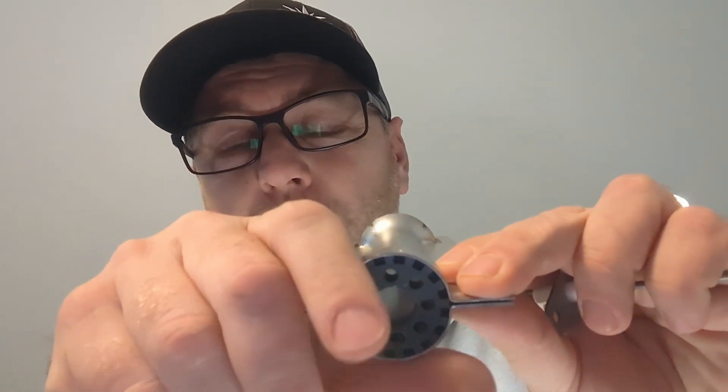It's bigger at the face of the burner and then it angles down and shoots into the heat exchanger itself. Majority of furnaces these days have tubular heat exchangers and your inducer is actually drawing that air through, helping pull that flame through the heat exchanger. If the burner starts getting rusted and deteriorated, it cannot burn the same way. All of a sudden your flame is a little erratic. You can actually get flame impingement where that flame is hitting that edge of the metal - specifically the corbel, where the fire enters the heat exchanger. It will actually eventually burn up and destroy that corbel.